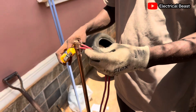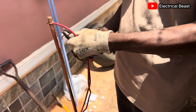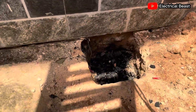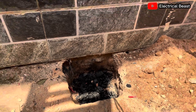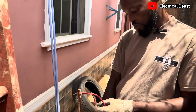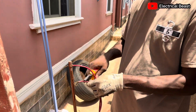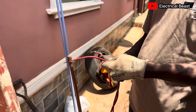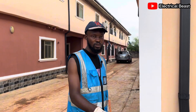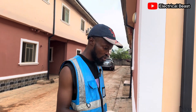Most of the current is going down into the ground. Check the hole — I've already placed charcoal inside to absorb moisture. I'm also going to add water in that hole, and when we bury everything we are going to leave the pipe and the covered box top visible. Thank you very much, see you in the next video. Please subscribe to my channel for more updates and tips on how to do these kinds of installations. Thank you so much, bye.